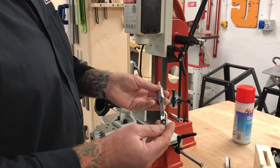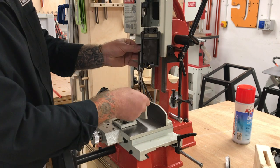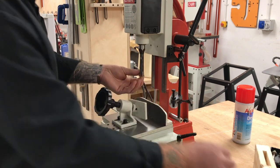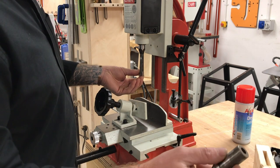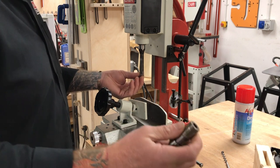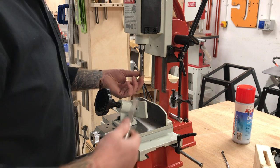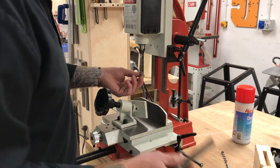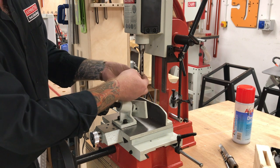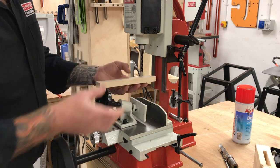We're going to place the bit inside the chisel and offer it up inside the collar. There's a little sleeve inside that receives the shank of the chisel. Two common sizes on this: three quarters of an inch and thirteen sixteenths — old imperial sizes. We've got a three-quarter shank with a 10mm chisel on this one. In this country we like to mix up the measurements. I'm going to push that up all the way in, being super careful as these are very sharp. If you're worried, just push it up with a little block of wood.